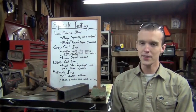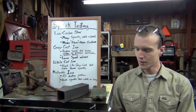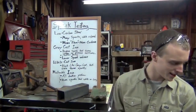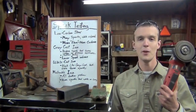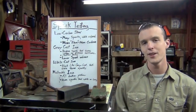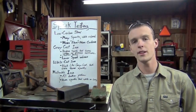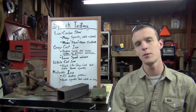What is spark testing? Basically, it's when you take a material of an unknown composition — for example, these channel locks, the generic equivalent — and you take this, get yourself an angle grinder like this 4½-inch Milwaukee, and you start grinding on whatever you've got. Just from the stream of sparks that shoots off, you'll be able to tell a lot about the composition of the base metal of whatever you're working with. This is designed to be a basic crash course in metallurgy and spark testing, and differentiating different types of base metals.